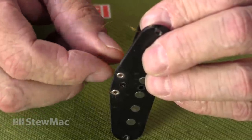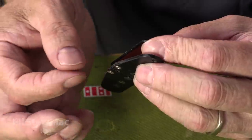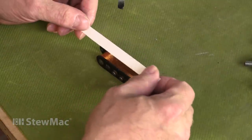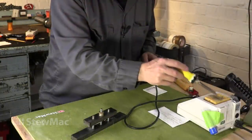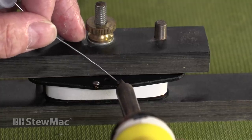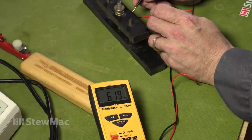Just like I did with the start wrap, I'm going to feed the finish wrap through the eyelet, pull it kind of snug — not too hard, because you really don't want to break it at this point — and pull it through another couple of times just to make sure it's in there good. For a preventative measure I like to put a little safety belt in here, where I gently tape a little paper sleeve around the coil so any solder or rosin splattering while I'm soldering it back up won't damage the coil. I'm hitting the eyelets with a little bit of solder so I can get a reading on the pickup. I was shooting for right around 6K, and it looks like I got right around 6.2K, which I'm happy with.